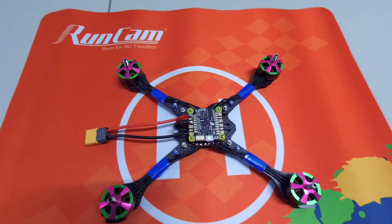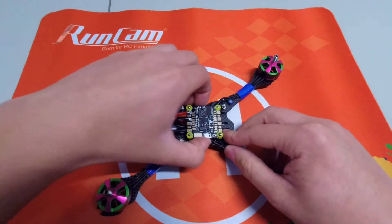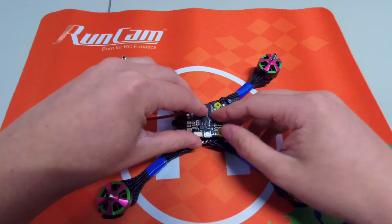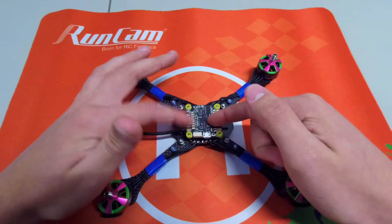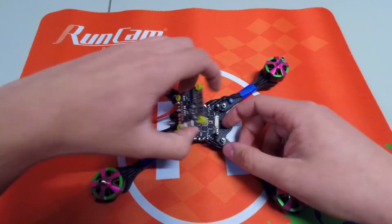Here it is. I only have the flight controller and ESC soldered together right now, just so it's a little bit easier to see — no extra wires dangling in front of the camera. When you get the SpeedX 30A 4-in-1, there's already an XT60 cable soldered onto it. You actually want to take that off to get current sensing. The way to get current sensing is to have your XT60 cable go into your CL Racing F4S flight controller — the pads are right on the bottom, super easy to get to. Then to power your ESC, you take two wires: one on the ESC positive and one on the ESC negative pad on the flight controller. It can be any of these pads; I just went with the ones on the bottom left of the board — a little bit easier to bend under to get to the ESC.